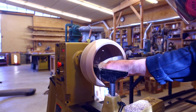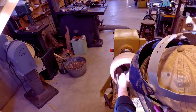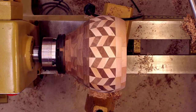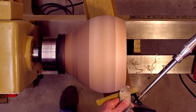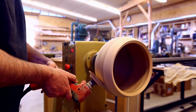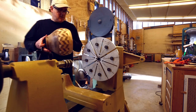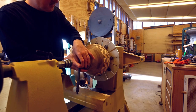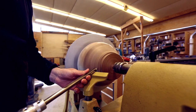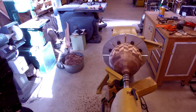I flipped it around and put it in the chuck — it seemed to work really well. My fear was that after moving the bowl back and forth it would be out of center, but it was pretty close to perfect, so I was lucky. I sanded from 60 grit all the way up to 600 grit, which gave a nice polished surface. Then I needed to turn the bowl around again to finish the bottom — a little tricky because I had to remember where the inside shape was, but the outside shape I wanted to make worked fine with the inside in the end.